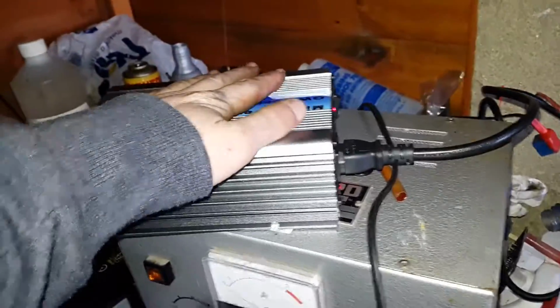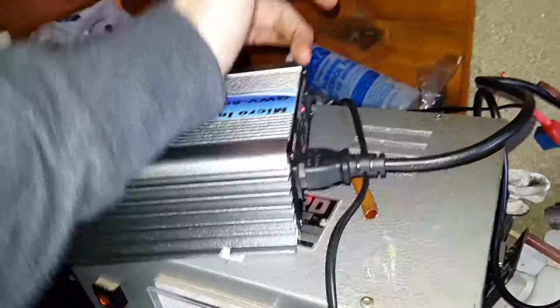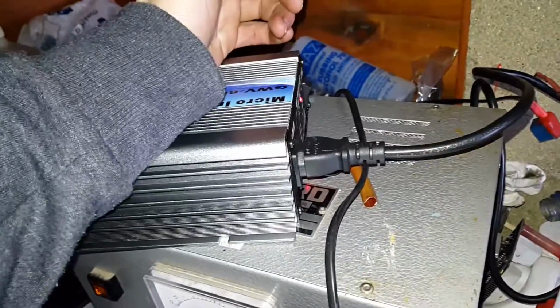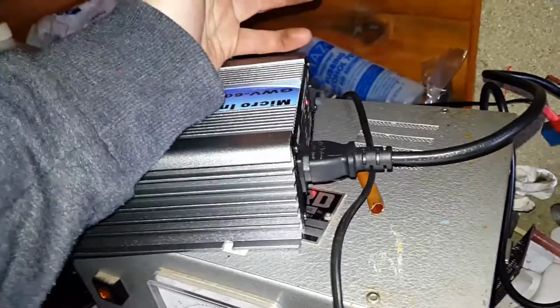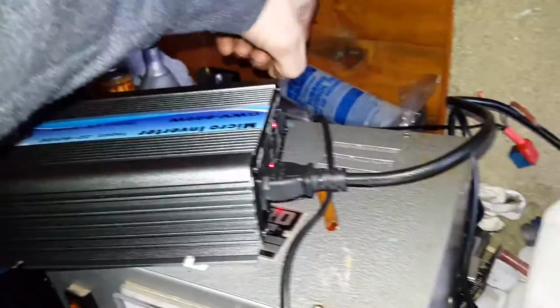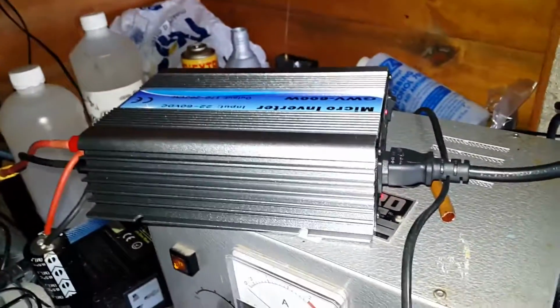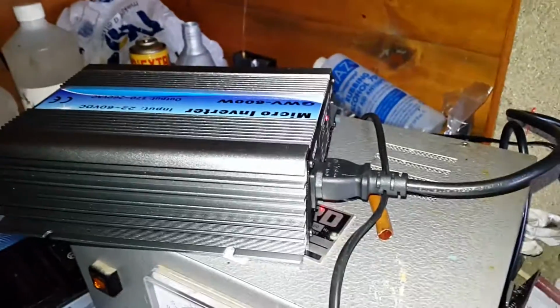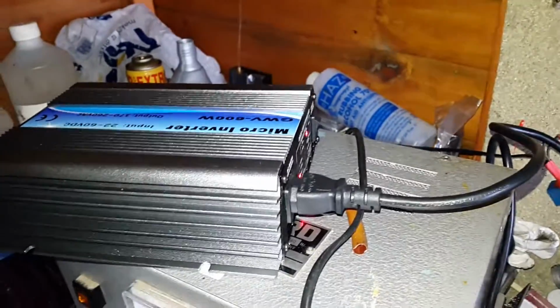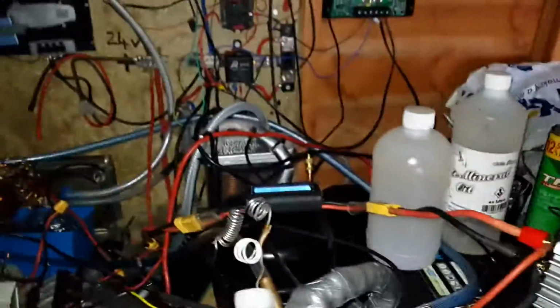It just means that the control logic is always on, and the output side, well, it's not like there's going to be a MOSFET maybe left on or whatever. I think that's quite unlikely, but or the control logic starting up erratically and then causing the MOSFET to go on and then short across the mains. So it's better just to have the DC side on all the time, I think.